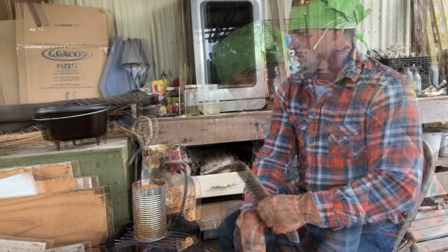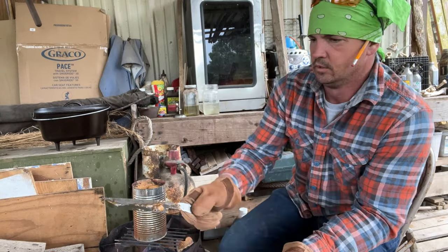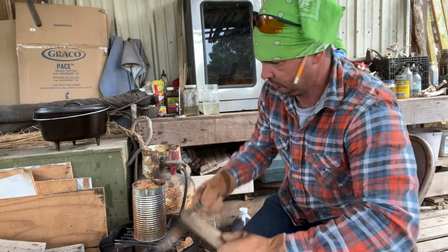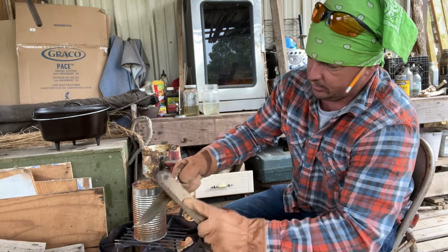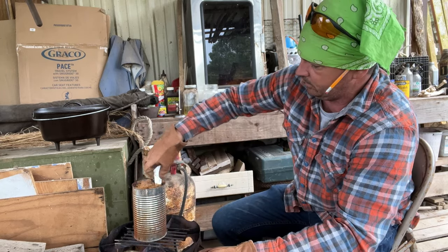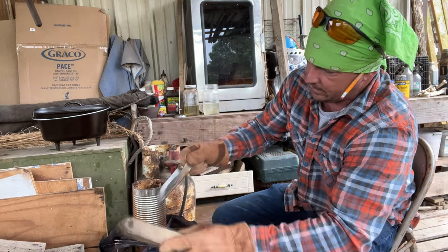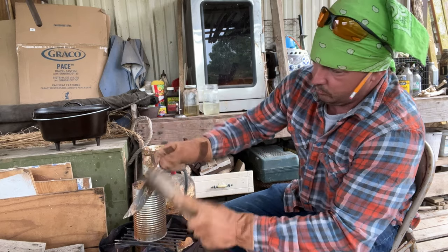Let it get warmed up and I'll pick you back up and show you what we do next. Okay — you take this knife out, you see that it is starting to darken. While it is wet, brush it. Dip it in there while it is damp, not after it comes out and starts drying. Once it comes out and is dry, it ain't doing nothing. While it is wet, brush it.